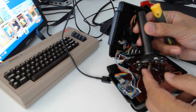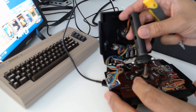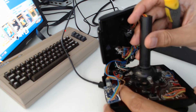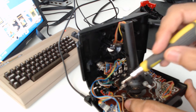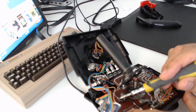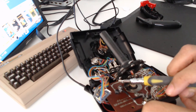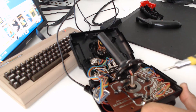The idea is to have the pan head at the bottom just so it doesn't restrict motion. Once you're fixed up, if you have the nuts on the bottom side they'll touch the board and the joystick won't work. So I've made up four strikers on each of the four corners of the stick, and that will be pushing down these buttons here. The original pads are actually under here as well. That little plastic lug would have pushed down on the leaf switch, which you can see is broken off here.